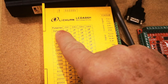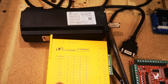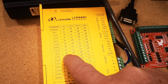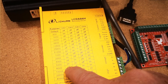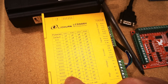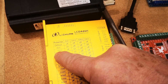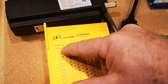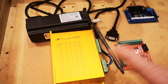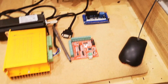I also found that the pulse-per-revolution setting made a difference. Originally I had it set at 1000 to match my 1000-count encoders. Raising the resolution made the problem slightly better. Going to the default of 400 steps made the error really bad, so I started testing at 400 because it made the problem show up more clearly.